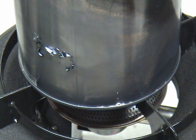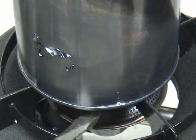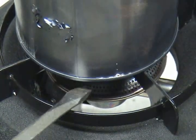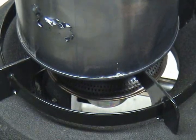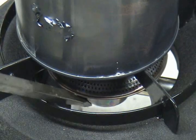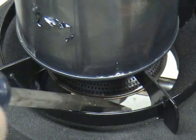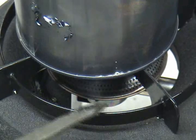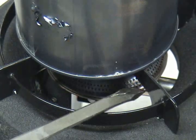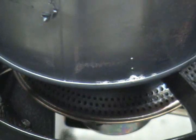That's covered in some of the books. Because this was so hot here in relation to this — this got hot and reflected back down here, heating this up — which caused the propane in air to thermally crack. This would be a partial oxidation reaction running down here in the bottom of the propane burner, producing hydrogen and carbon monoxide. Especially hydrogen, which burns in a smaller orifice.